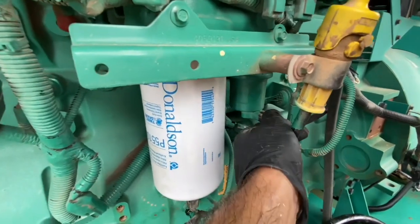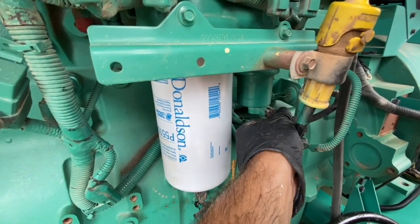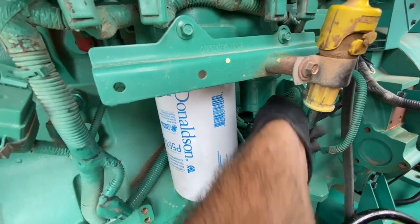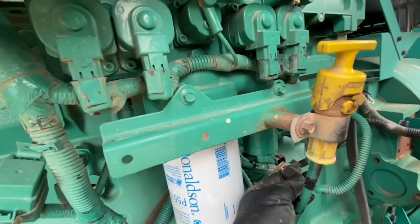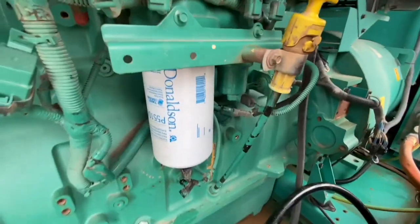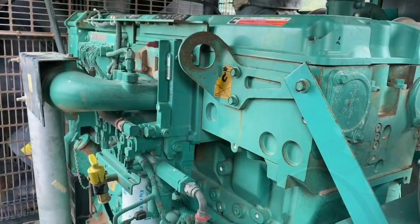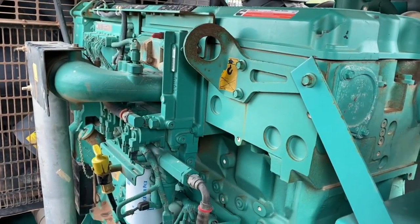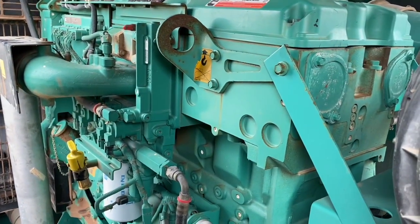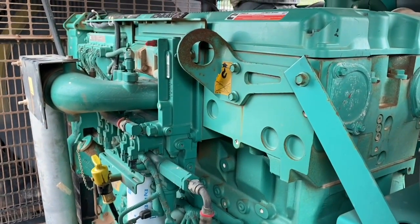That's been long enough. There's a nice consistent sound coming out of the fuel pump, so it must have a full rail of fuel. We'll pull our plug out and put the engine harness plug back in. These fuel pumps are only for priming - they don't run under normal operating conditions. Now we're going to start our engine, and it should start up fine with no knocks. And it's running well.